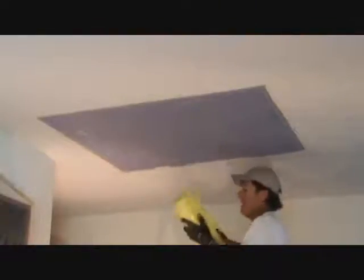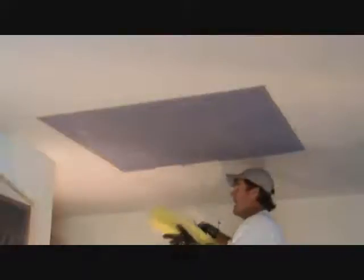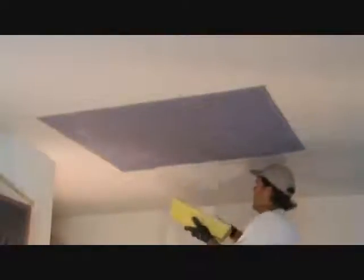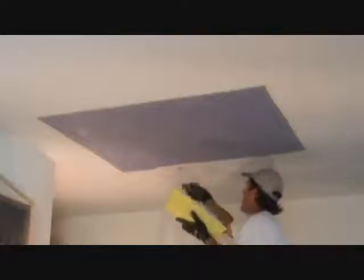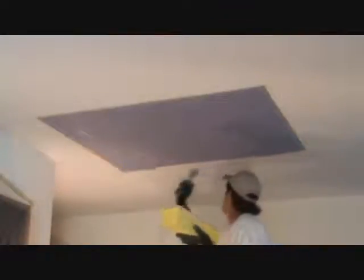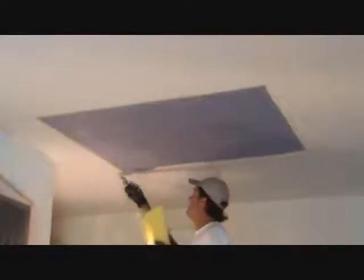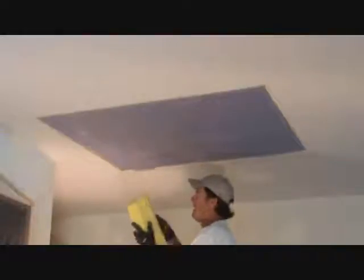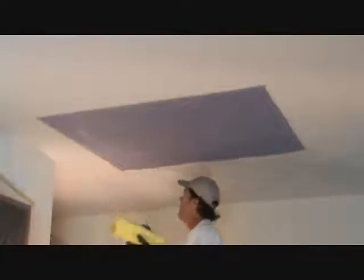You can reach out this way. You're going to get to a point where you don't want to move the ladder any more than you have to. Just start practicing how to put this stuff up. Make sure you get the tape all the way around on the edges. The main thing is, once you put it on, the great thing about that webbing tape is you're actually pushing the mud all the way into the sheetrock.